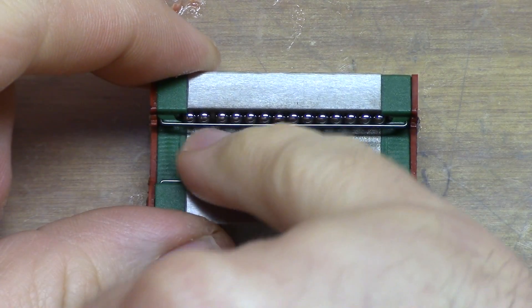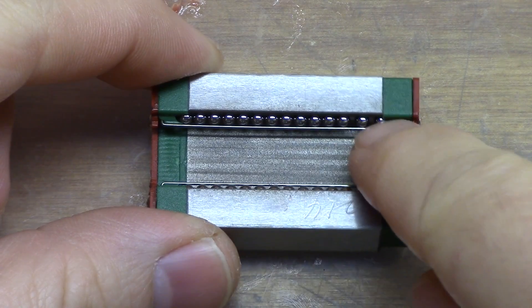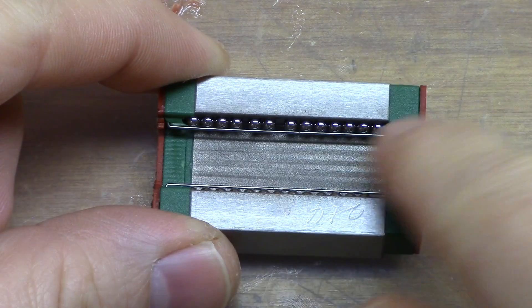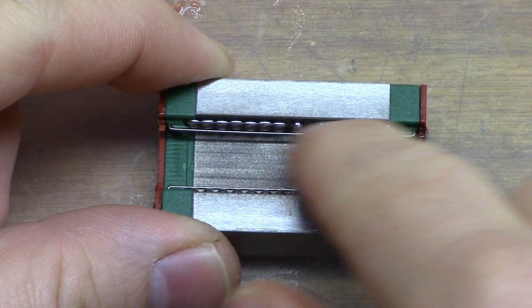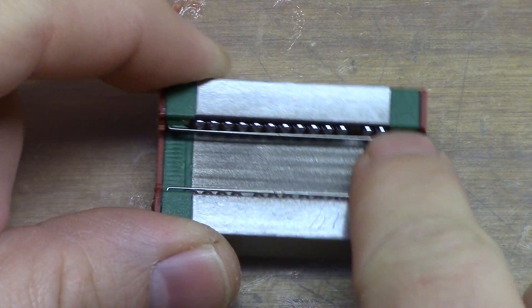Just move it to the end, work over your container, and then slowly pull it off — that's it. Looking inside you can see you've got this metal cage that keeps the balls in place. They recycle through the chamber inside in a circle, and that gives you that nice smooth steady motion.